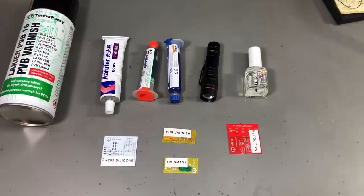If you want to protect your PCB professionally, you might use conformal coating. You get in touch with a manufacturer that can supply it and they will advise on different coatings they can offer. You will usually find clear conformal coating in either a soft re-enterable form or a solid coating. The soft re-enterable form is used if you need to do measurements or mods later on your product, while the solid coating, once it's set, you can't pierce through it for measurement because if you do that, you will break the coating.